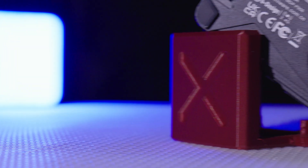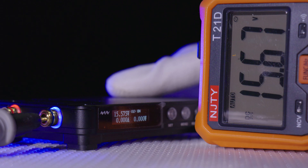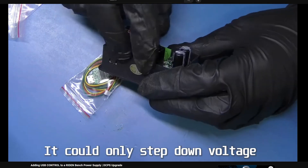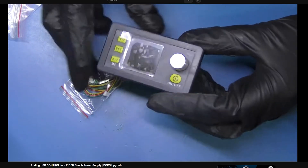What's really cool about the 906 is it has internal boost conversion in addition to buck conversion. This means that with only my 12V input, I can output anywhere from 10mV to 30V, taking into account current restrictions also. My previous tiny bench power supply didn't have any built-in voltage boost converter, so I was limited to my power brick voltage.